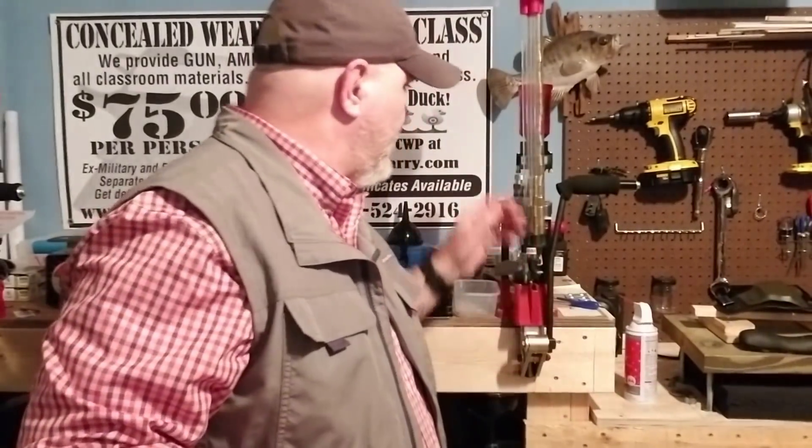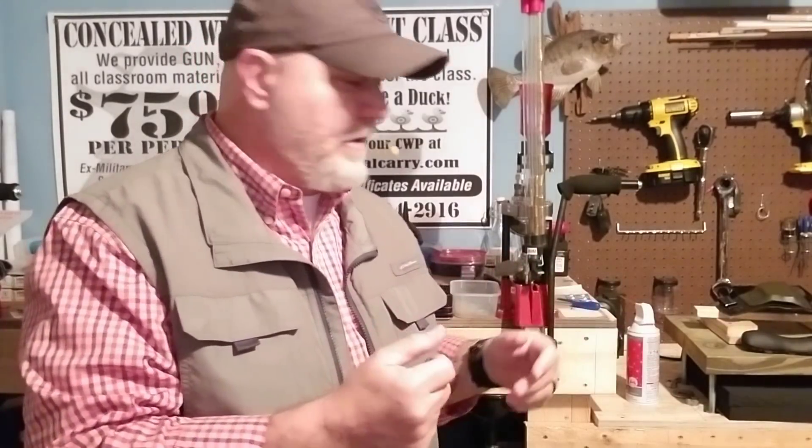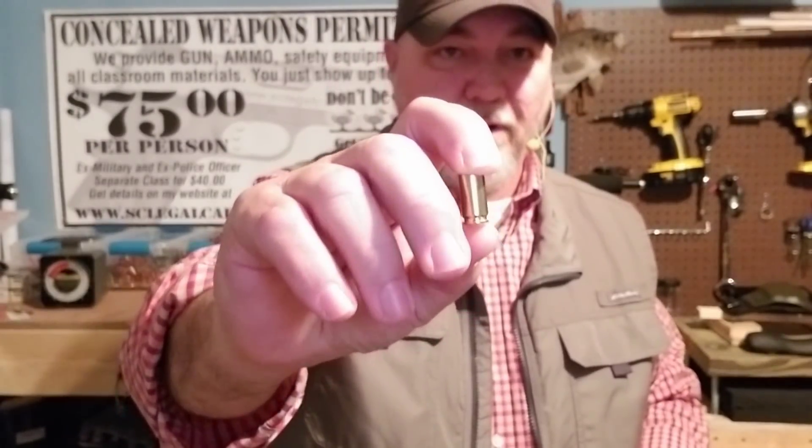What I want to talk to you about is I was going to shoot last week and I was working with my Lee press. I was having trouble — it wasn't rotating, it wasn't functioning, it was hanging up. It's a multi-stage press and my primers kept getting hung up. I kept having to go backwards and forwards. Usually when I do that I stop and take all the casings out so I don't make a mistake and double-charge or not get powder in one of the casings. Well, I kept messing with it. I was in a hurry — I wanted to go shoot — so I ended up not getting any gunpowder in one of the casings.